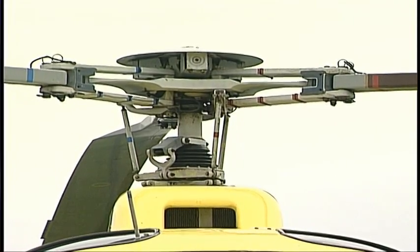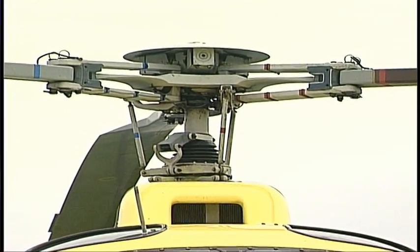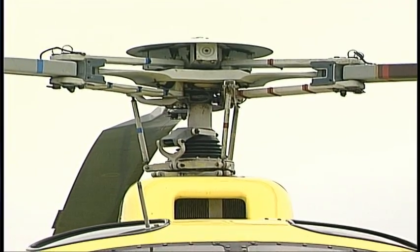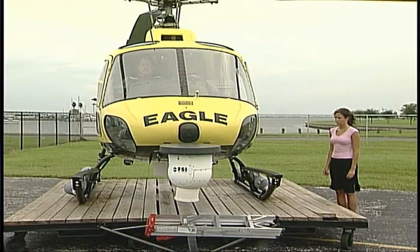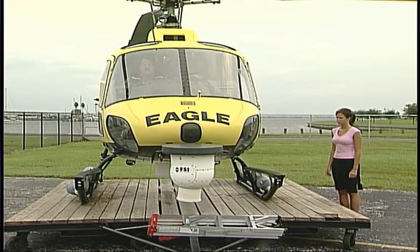As you come to the aircraft, be aware of where the rotor blades are so that they don't flex down and hit you. They only come down to about 7 feet, but in a gust of wind, you have to be conscious of the height between the blade and the ground.